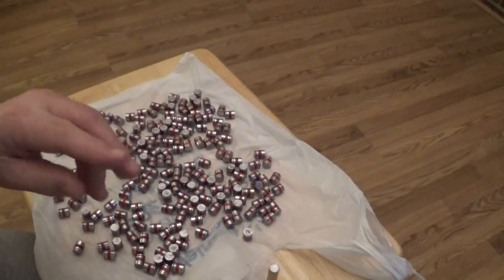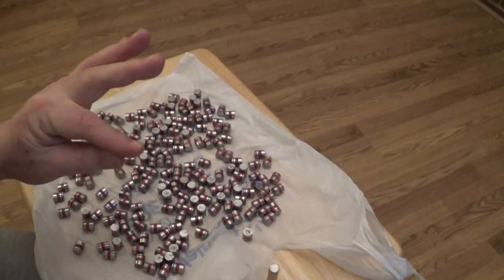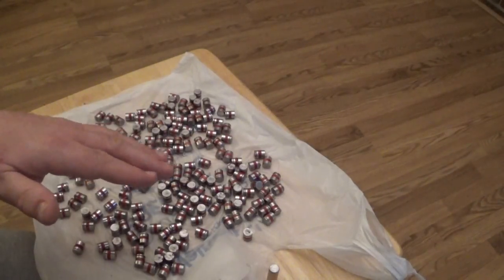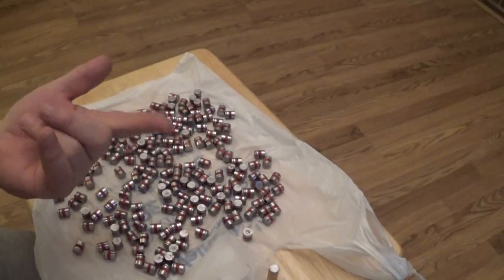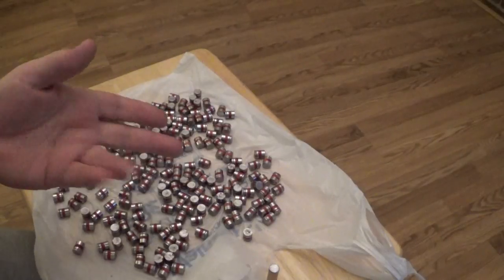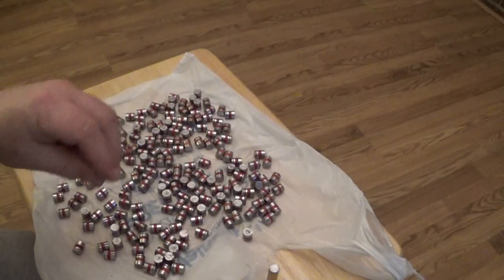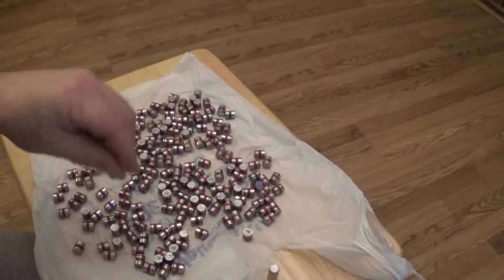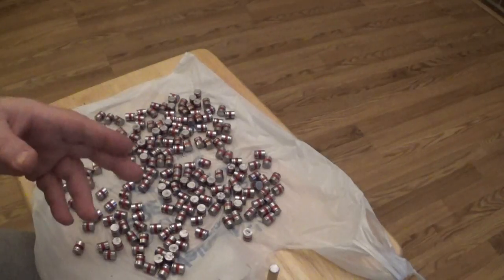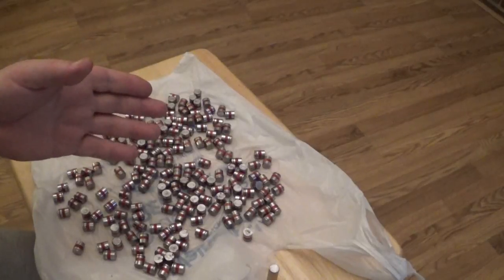You have to be careful when lubricating your mold — you don't want to touch the inside face of the mold or the cavities, because then you'll get wax in the cavities and you're kind of screwed. You've got to get in there with a Q-tip and clean it out repeatedly, otherwise you'll have to go through about a hundred castings to get rid of that wax.